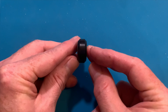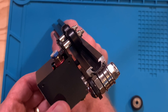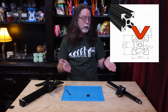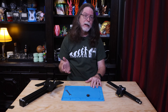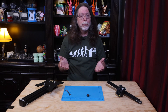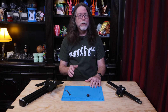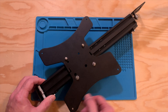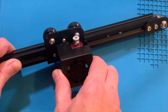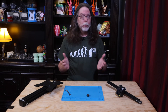This is a V-slot wheel, and it's designed specifically to roll along in the slots in the aluminum extrusions. Interestingly, by an astonishing coincidence, these aluminum extrusions are called V-slot aluminum extrusions. Nobody knows why. The reason the wheels need to be adjusted is that from the factory sometimes they're either too loose or too tight. When they're set too tightly, the wheels will develop flat spots on them if they stay in one position too long, and you can feel those flat spots when you move the printhead or the bed manually. If they are set too loosely, the parts attached to them — the bed, the printhead, or the entire X axis — can wobble or be imprecise, and these issues can adversely affect your print quality.